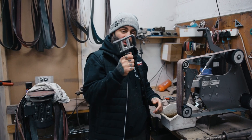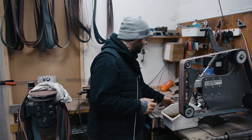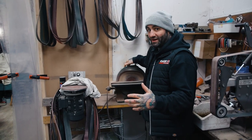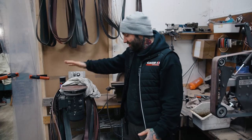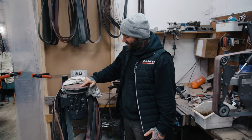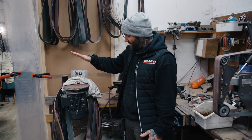I have a lot of attachments for this grinder, including a small wheel attachment for getting into niggly little areas, with different sized wheels. Not only do I use a 2×72, but I also use disc grinders. I have one disc grinder for flattening off blocks and knife handle scales — that's just for wood. And then I have another disc grinder solely for bevels or knives. The difference with this one is it's slightly crowned, so when I'm grinding the blade, as I go over it's not going to catch the tip and fling the knife out of my hand.